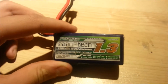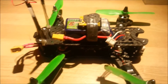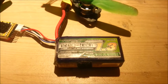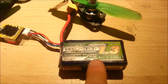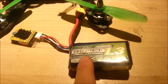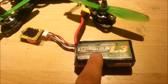C ratings are quite important. If you're running a high-powered mini quad — this isn't very high powered but it's still a mini quad — then you want probably a higher C rating. This is a 45 to 90 C battery. The C is the capacity, so 45 to 90 C. This battery is 1.3 amps, so it can supply 45 times 1.3 amps constantly, and it can supply a burst rate of 90 C.